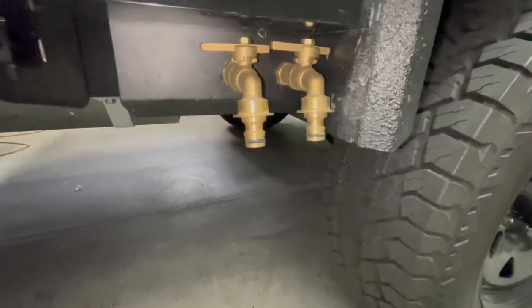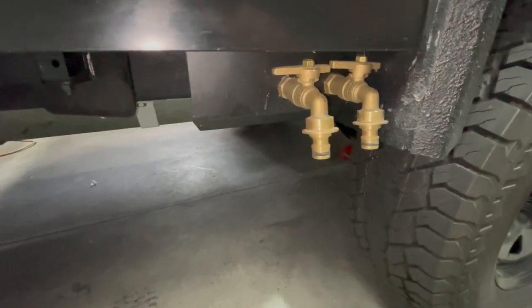I've also got two taps on the outside. One of the taps operates as a fill point for the tanks, so a bottom fill point for the main tanks. The other tap operates as an outlet point for when I turn the pumps on, I can run water out there to fill a bucket or whatever. But when you click onto that with town pressure, it repressurizes the system in the other direction, so I can put town pressure through the whole thing. Jump on to the next bit.